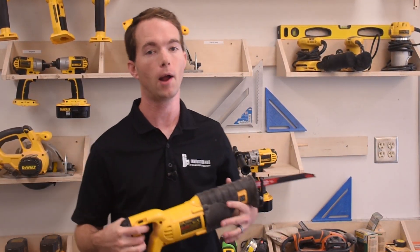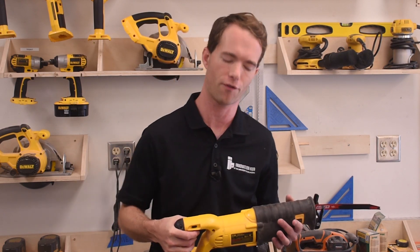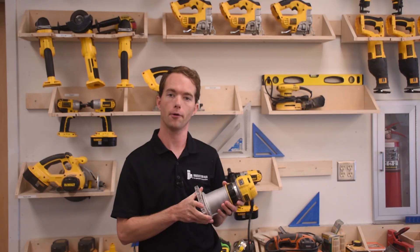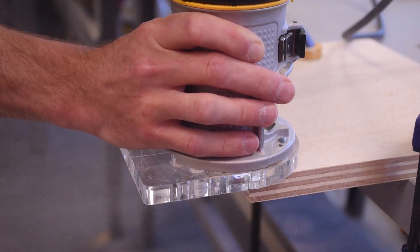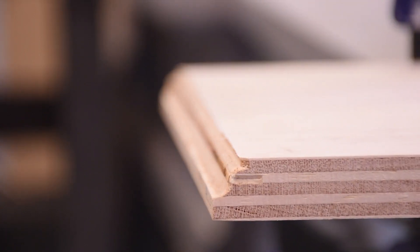Like all these other tools, you must wear safety glasses. You might want to wear earmuffs and whatever other protective gear, but at a minimum you need to wear safety glasses because things can get thrown in your eyes. Another tool you might want to use is this little palm router. A router is used with various shaping bits to create grooves and change the edge profile of pieces of wood.